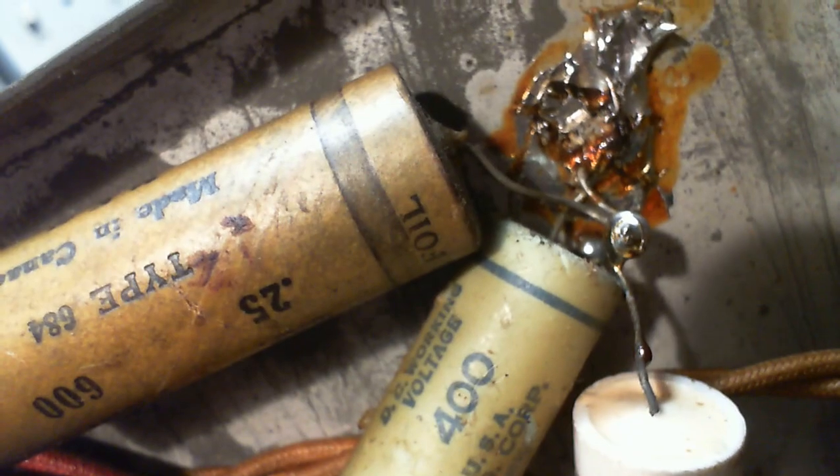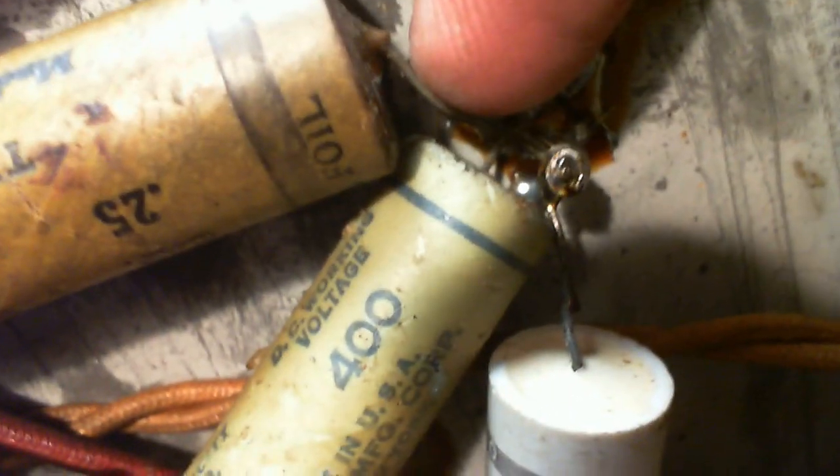Airborne connection. So they're into the airborne connections in this radio. There's one here, another one in here. It sounds like that was a standard practice. Here's another one here. Okay. Well, once again, if we look at these capacitors here, especially this one, this just doesn't look right. This looks too new. You can see, I think this is a definite sign of a replacement here. One or all of them got replaced. These don't look replaced. That one does, though. So I think it's safe to say a little bit of work's been done.